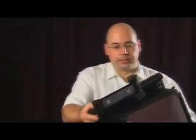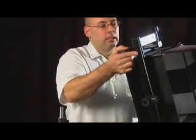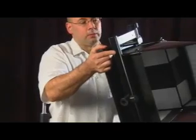Now, it has barn doors here, and they're really important. Aligning these barn doors is going to determine or help you to tune your light levels on the rear projection screen, which we're about to mount. So I'm going to grab that unit, we're going to put it on, and I'm going to show you a few details about it. We've got it more or less assembled, and we're going to fire into the back here so you can see there's a mirror back here, and that mirror is basically going to reflect light onto the panel.